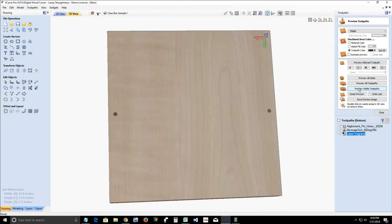Doug asks for a quick refresher on how to clear the offsets in CNC USB controller. Steven, thank you very much. Doug, you just click the button that has the red X with four yellow arrows around it. Steven was close. He just mistyped it, but it was the same thought. You were right, Steven, but you just had a little bit backwards. It's the red X with the four yellow arrows around it. That'll clear the offsets out in the CNC USB controller before the beginning of each job.